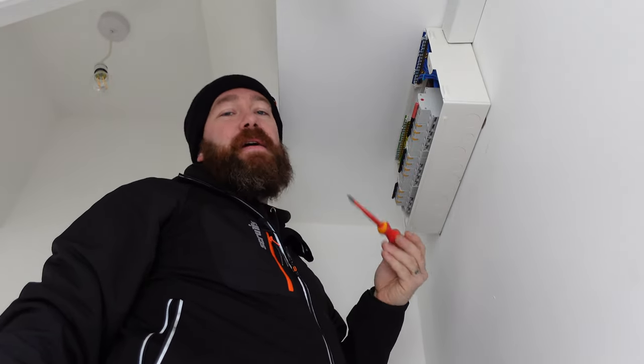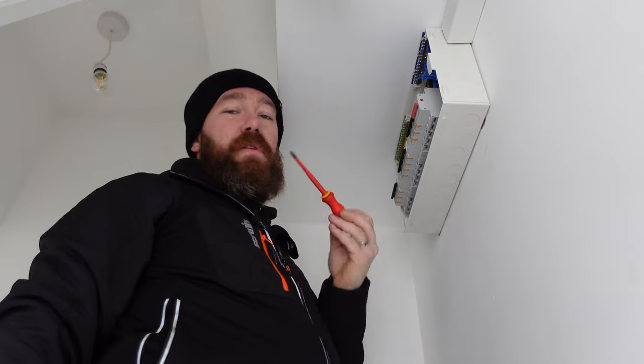We're going to be taking bits out and bits in. So I'm just going to do it with a normal screwdriver now and re-torque it all after. Right then, onto our circuit tests. I do the ZE first. It's not in the on-site guide to do that first. You should do all the dead tests first, but I'll just do it. It's done, the earth's reconnected, everything nice.